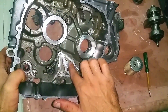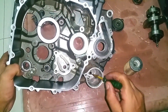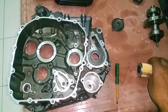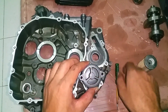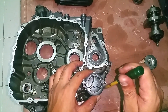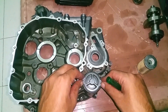This is where your oil pump goes, and this line over here — as you can see behind it — this is where the oil goes in and comes out from this end. I'm going to use this portion as an inlet and outlet. I'll eliminate this one, put a giant hole inside this cap, put another hole over here, and mount a pipe inside. We're going to use AC — air conditioner — copper pipes over here.